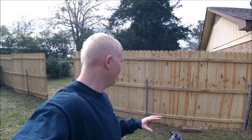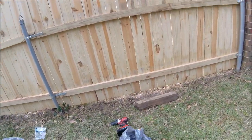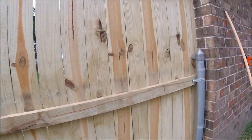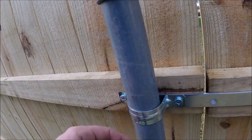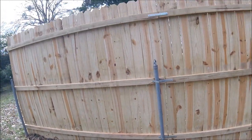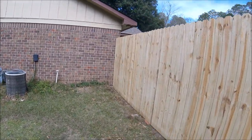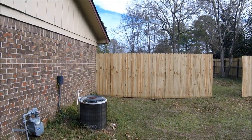We have the first two panels put up. We used the level, bricks, and a wood spacer to get the right height, and made sure it was level all the way across despite the uneven ground. I got smaller clamps - inch-and-a-half - whereas these are two-inch clamps for the bigger post. Being slightly too small helps because they have to bend and get sucked up tight to the fence, which keeps them from falling and sliding down when you take the bricks out. I think I'm going to use these same brackets to connect the two pieces of the gate once I cut the end off. Let's take a look from the front - very satisfied with it so far.